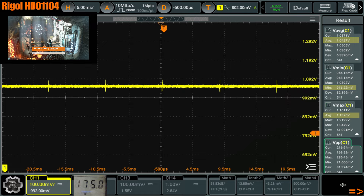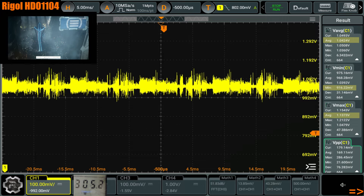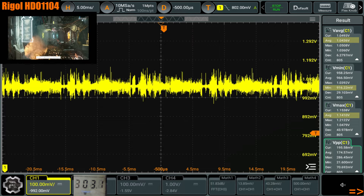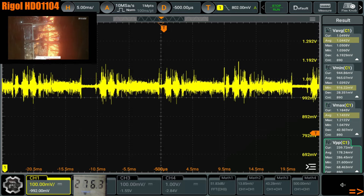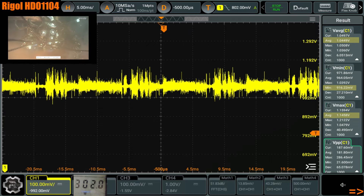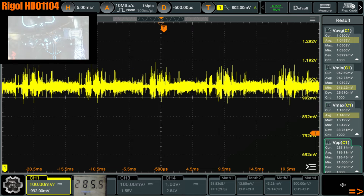What we should see is like a 200 or 300 point increase in the score just by disabling the V-Droop — which is just a thing on NVIDIA GPUs. I've seen the same effect with a GTX 970 where you don't touch the clock slider, you just disable V-Droop or raise the average voltage, and you end up with more FPS. Because the clock readouts in the software lie constantly — I am not certain you can actually get an accurate clock measurement from NVIDIA GPUs.